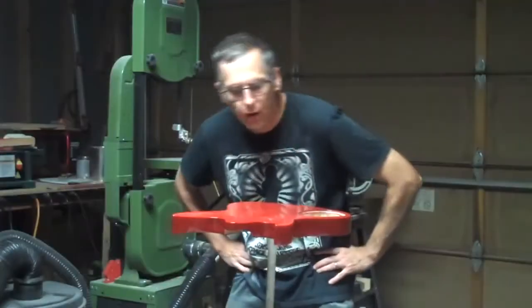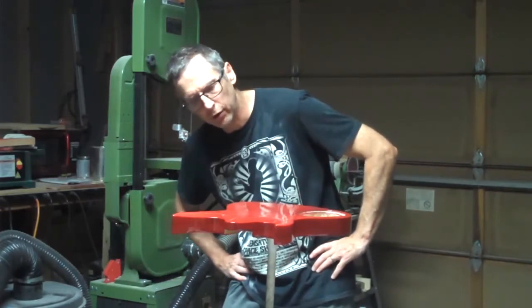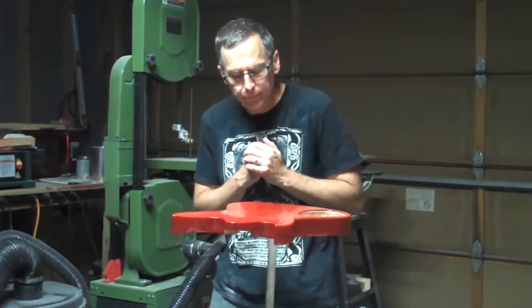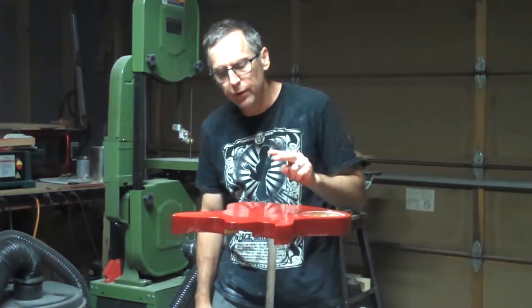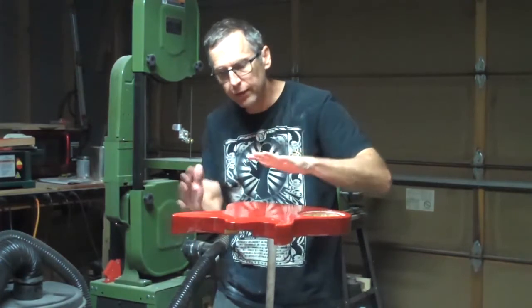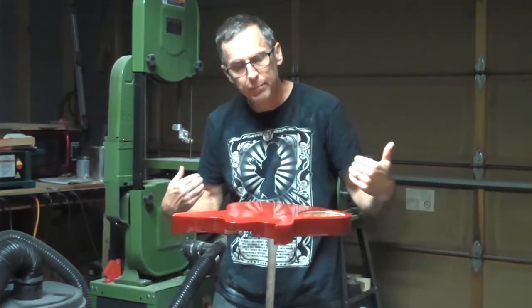Okay, so our 90 minutes is up, and I am ready to take the guitar out into the sun and cure the Solarez. I'm going to do this in 2 steps. First, I'm going to take it outside and expose it to the sun for about 10 seconds on each side, and then I'll bring it back in for about 5 minutes.